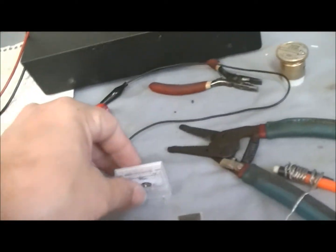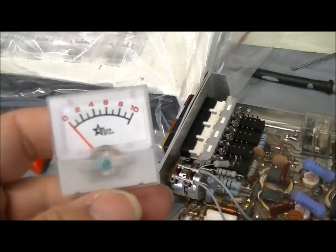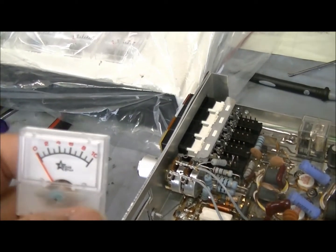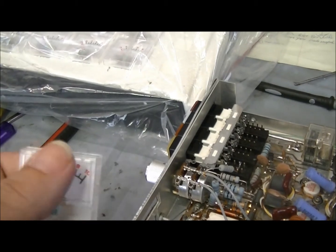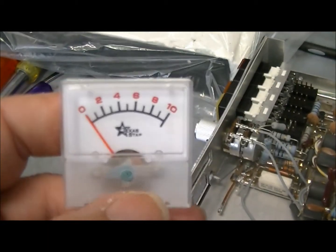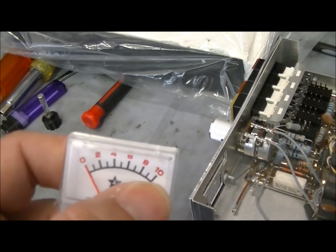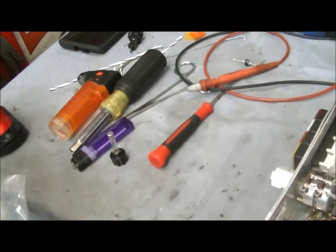Since then I've been using a better method because I have damaged a meter or two drilling them - sometimes a little piece of plastic gets down in there. I'm using LED strips now and they seem to light it up a lot better. Sometimes I'll do a strip and also drill a small 3mm LED hole to light up the bottom a bit better. You don't want to light it up so bright you can't see the numbers. These meters are reading essentially in amperage - 10 equals 0.10 milliamps if I remember correctly. There's an actual science behind how these meters are designed.